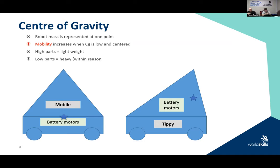So we saw this quite a bit. It's not so much that we see this if you're working in autonomous mode. We see it a lot more for people that use teleoperation because they get very, very excited. And before they start driving the robot, or before they drive the robot forward, they forget to lower a lift mechanism that's up that has increased the center of gravity.